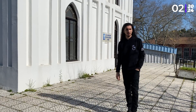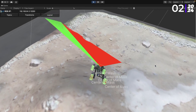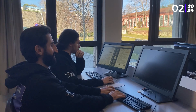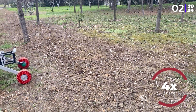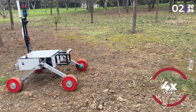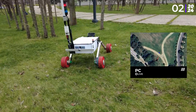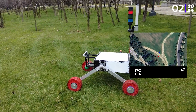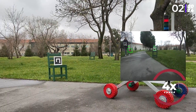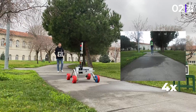We improved our previous work with deep reinforcement learning-based autonomy with 3-dimensional analysis support, enabling travel in rigid and sloped conditions. For real-time location accuracy, a long short-term memory-based sensor fusion model combining a ZED stereo camera, BNO055 IMU, wheel encoders and RTK GNSS was designed and trained in real-life conditions. Combined location and motion data are brought together in an integrated QT-based, real-map-supported mission planner. The planner can tolerate connection interruptions with the ability to automatically switch connection frequencies. Using custom image datasets, we can recognize objects and obstacle levels, instantly determine their location and relative angles, and include them in autonomy.